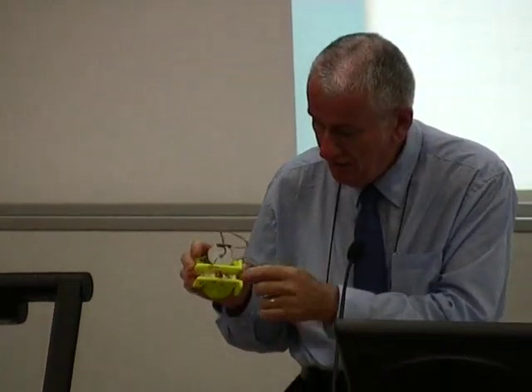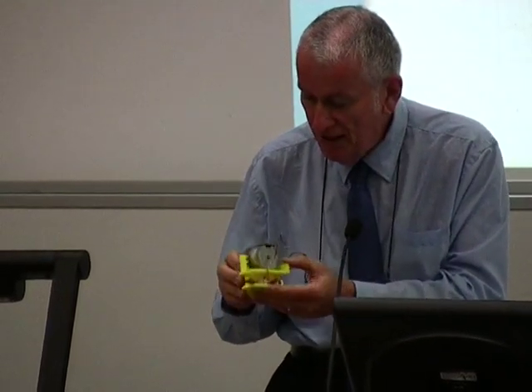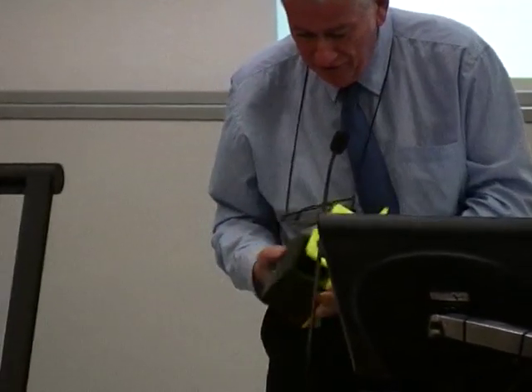This is Alan's implementation — sort of phase one — used to drive the vacuum capacitor. Behind here we can see a couple of limit switches, just ordinary single pole limit switches. The idea is that you drive the stepper motor until one or other of the limits is reached, and hopefully it will step no more. These yellow pieces and this piece here came off Alan's son's 3D printer, and as 3D printers become more economical, I expect there will be more of these and similar projects seen around.